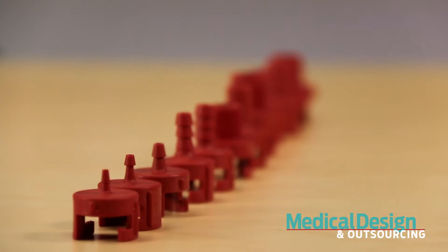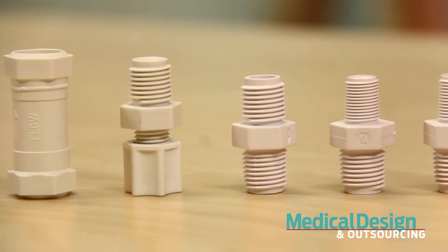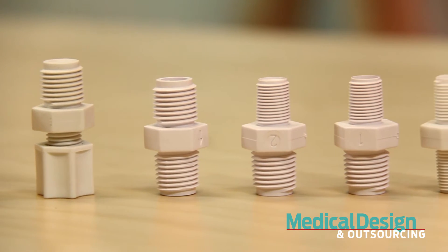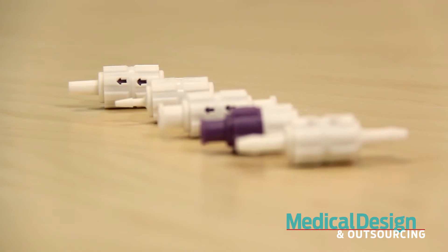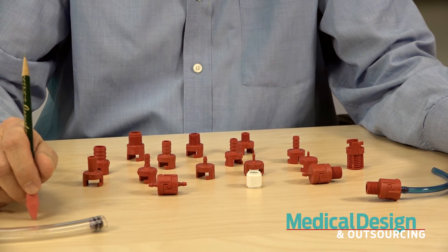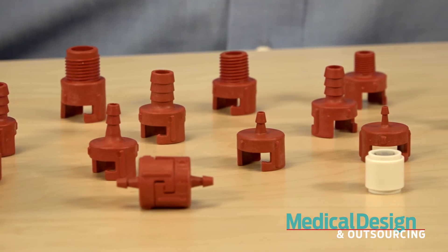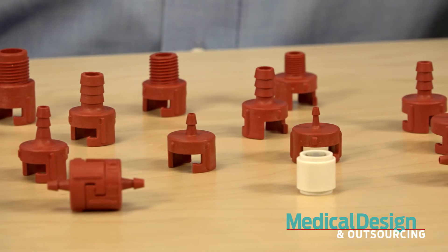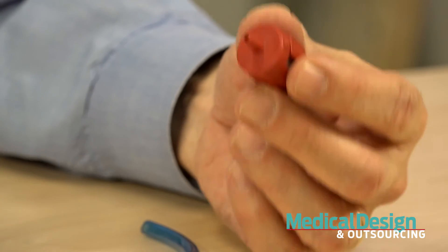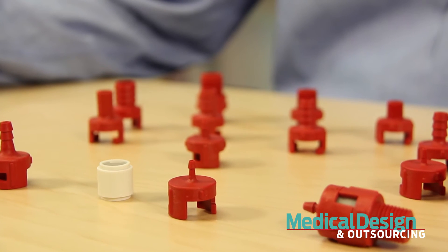The company offers at least four series of fittings and valves. For instance, the Series 100 are standard cartridges with styles in barbed, side-sealed, flanged, and others. The Series 200 are NPT fittings, and there's a mini modular 500 series, but we're going to focus on the Series 300 modular fittings for this video. For the Series 300, the company offers end fittings in barbed sizes ranging from 1/16th of an inch up to a half an inch, plus NPT sizes, and others such as the foot filter, a manual relief version, and some with smooth stems.